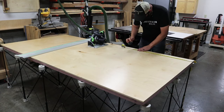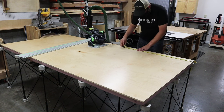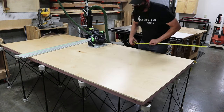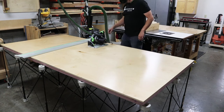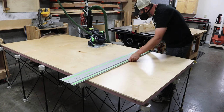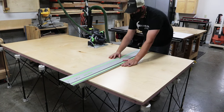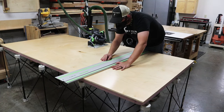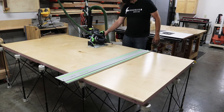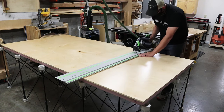To begin, I need to break down all of my cabinet parts from this pre-finished three-quarter inch maple ply. This stuff is fantastic for cabinets because no sanding and finishing needed. My favorite way to break down plywood is to put it on this expandable work support with a piece of foam insulation providing a nice cutting surface. It allows me to cut with my track saw at a very comfortable height.